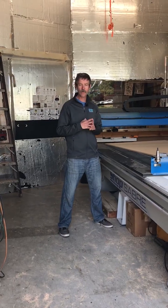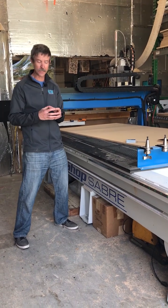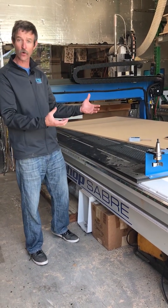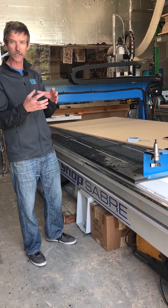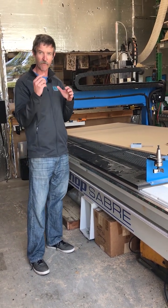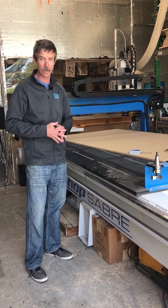Alright guys, now we've got the table exposed here on the ShopSaber grid. We always talk about the importance of that grid gasket — the proper grid gasket. We often talk about square gasket and square channels. When a channel is flared open like this, we often recommend the round cord that we'll see here in a minute. When customers either glue or caulk their spoil boards down, it leads to unevenness and varied surfaces. That's why it's so critical to get that proper grid gasket in there to get that fresh, clean seal all the way around. We'll see in a moment what the difference is between the holding power with gasket and without, and see what kind of improvement it can make on your machine.